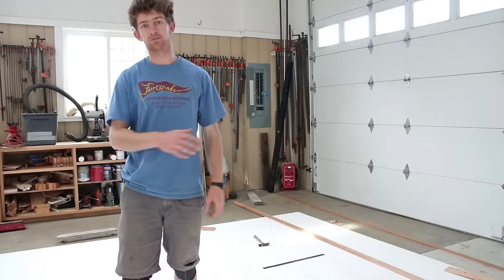Now I've never actually lofted anything this size with this degree of accuracy before, so I'm just figuring it out, and what I'm realizing really is I probably should have not done all of the sections on the body plan at the beginning, because it's a circular process. You do one bit and then you go on to fair those lines in from a different view, and then you go on to fair those lines in from another view, and you just keep going around. You end up back with the first view, changing the lines you originally drew, and then each step everything gets a little bit closer to being fair in all dimensions.